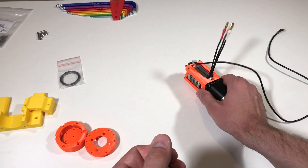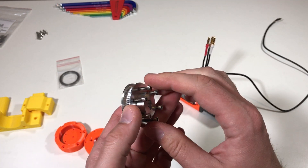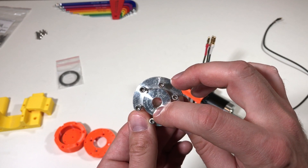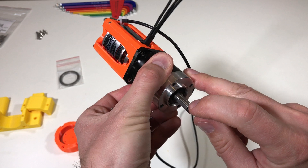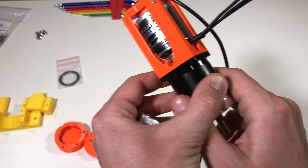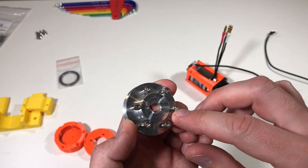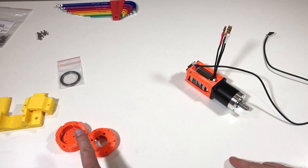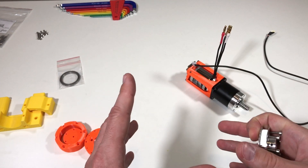In order to attach the arm on the output shaft of the actuator, I've made this piece. So this is an aluminum pulley in which I made this notch with the file. This notch goes on top of this keyway on the shaft. I also drilled six holes and made threads in these holes for M3 screws. I also 3D printed some of these parts, so like this we can assemble all these into a small nice package.